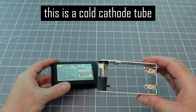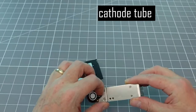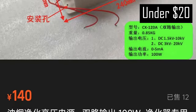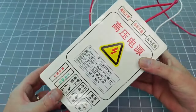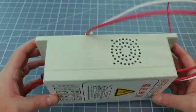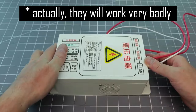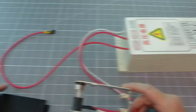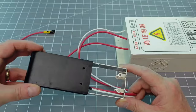So I figured, why not just use the tube and the existing enclosure and add a separate high voltage power supply. I found a power supply on Taobao that seemed like a great deal and could produce DC voltages up to 20 kV. I have seen some YouTube creators trying to use power supplies intended for neon signs — these will not work, as they have AC voltage output and x-ray tubes require DC current. I hooked the power supply up to the x-ray tube and got ready to make the first test.